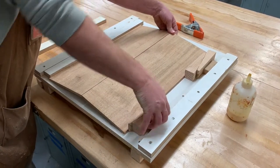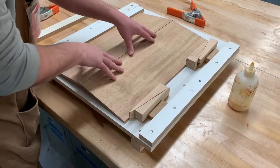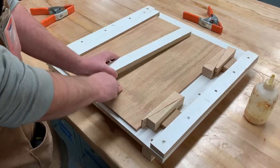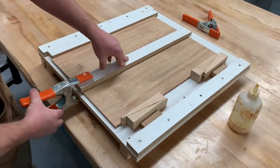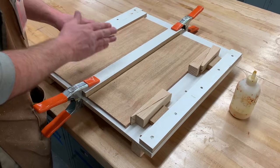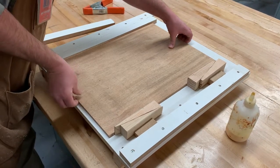Position the boards so they're sticking up a little bit from the jig, then put pressure down. If you can't get it to go down, adjust the wedge blocks a little bit until you can press it down — it'll hold really tight because of those wedge blocks. I've also got a little strip of wood with wax on it that you put right on the very center of your board so any glue that squeezes out doesn't stick. It's good to practice with no glue first to see how it's going to come together.